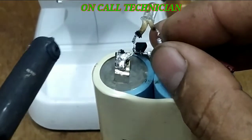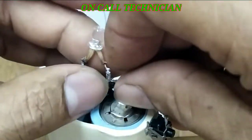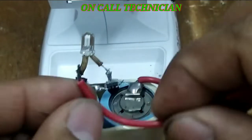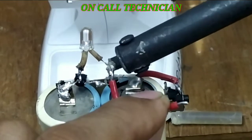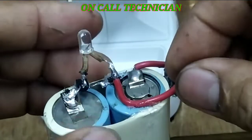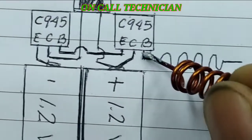The emitter connects to the negative of the battery. Connect the LED positive to the collector of the transistor. The line from the LED to the collector of the transistor connects to the switch. I just put adhesive to the positive line as well as to the two transistors.